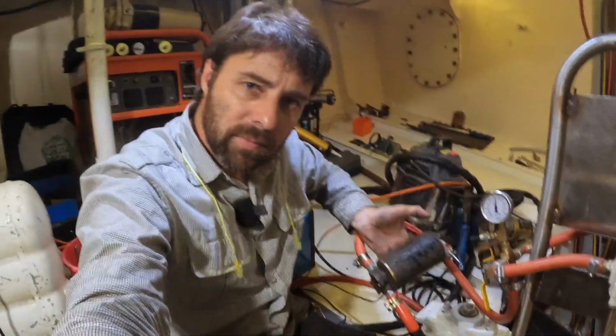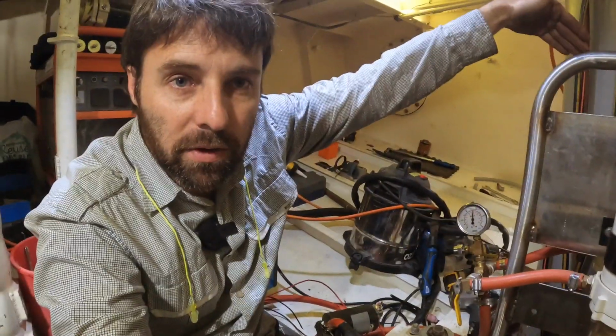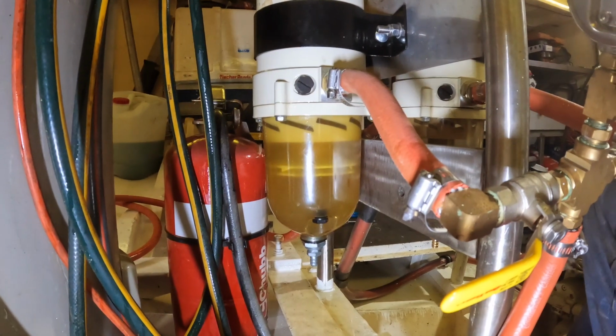All right, my elaborate system, 12 volt fuel pump here, pushing into our temporary fuel manifold on the hot swap filters. I'm just running it through the back filter at this stage, but then it's going out of the filters and up into the tank. You can sort of see over the back here, we've got a pipe going into the top of the tank. What I'm hoping is that I can push the fuel through the fuel filters and dump it in the top, and then I'll be able to hear it pretty much that entire time that it's filling up, so I know that it's working. I won't have to be constantly guessing because I don't have a sight glass on that tank yet. I'm actually pushing it through the top fitting of what the sight glass would normally clip into. So I'm hoping you'll still see a few air bubbles come through this filter.